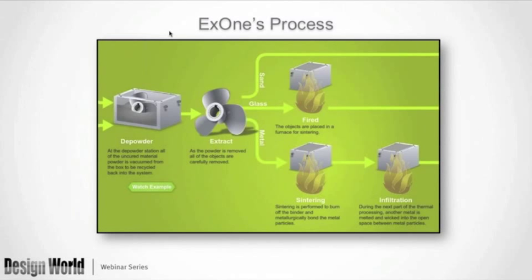If you're printing in direct metal, we will then put it into a large vacuum furnace. These parts sit in a small graphite crucible or large graphite crucible, depending on the parts and the part complexity, and we'll supply bronze to that stainless steel part. Once that part is covered with grit, we'll put it into a furnace, and around 1100 degrees that bronze will liquefy, and that printed part will act like a sponge to water, basically sucking up and infiltrating the part. The part is around 95 to 97% dense. This is where the sintering and infiltration is happening, down on the bottom right.